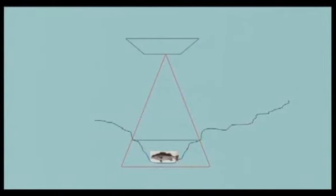This becomes very important when looking for fish on the bottom, and this is due to an effect called target masking. You'll see that the seabed isn't quite flat, as the rocks come up on one side. The way a sounder works, as soon as it receives an echo from the seabed, it will tell us that's the depth. If we had a slightly wider beam in this picture, we would in fact be told the depth to the rocks, and everything else beneath it would be missed.